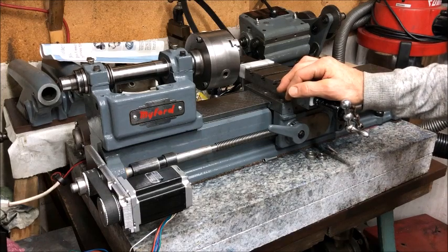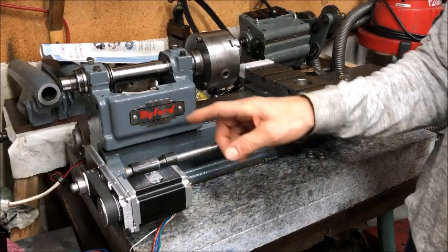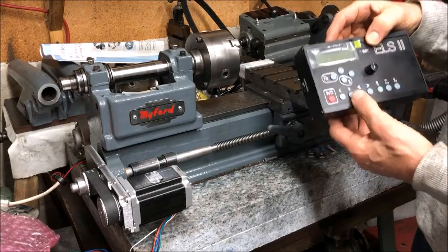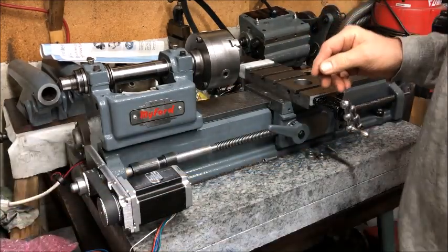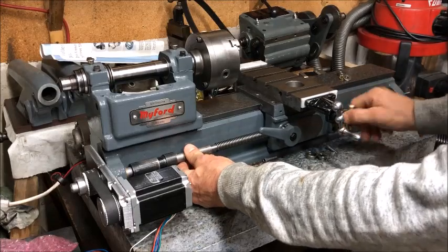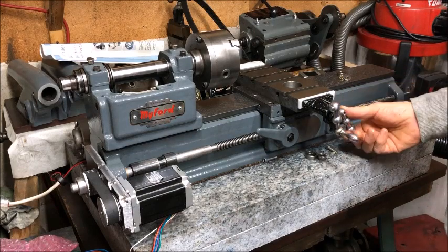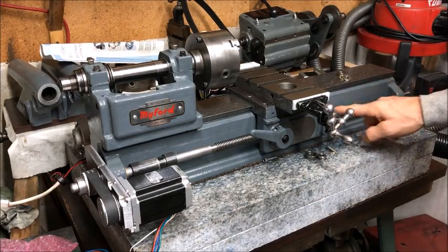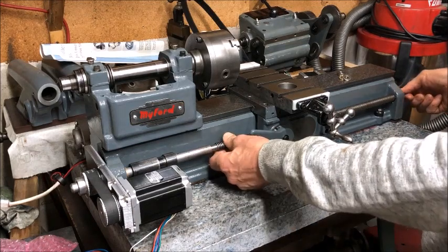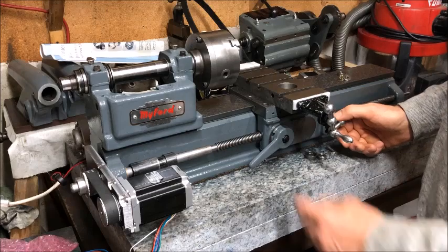From a point of view of driving the lead screw in the way that the ELS operates — this is going to be an ELS-operated machine — but also retaining the basic possibility that you have with rapid feed on the ML10 through the lead screw here, and also then with the hand wheel for normal manual operation of the lead screw with the clasp nut.